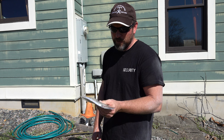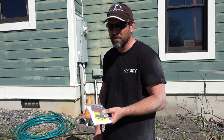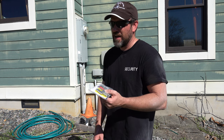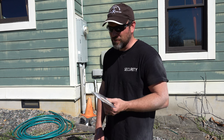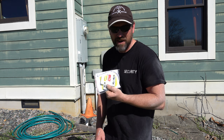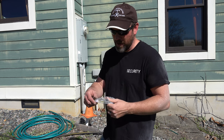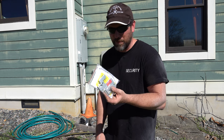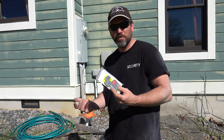Another issue is you don't want power back-feeding into your generator or whatever device you're using. We're going to be using battery inverters — you could blow them up. You could have some serious issues. So it is extremely important that the main breaker is off any time you're using a generator with your inlet service box. So you get one of these — they're only 20 bucks and it's not that difficult to install.